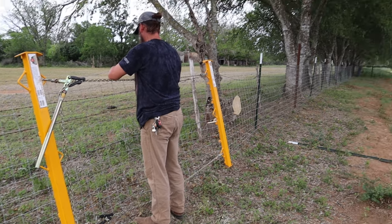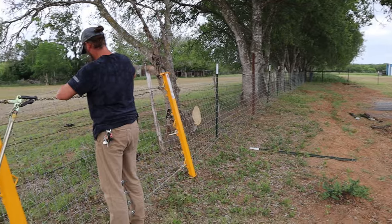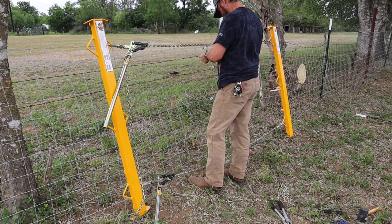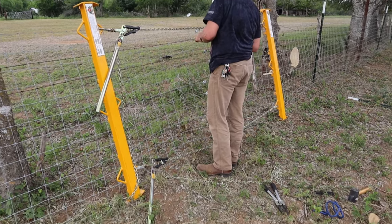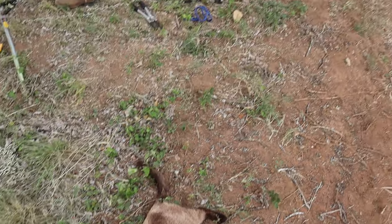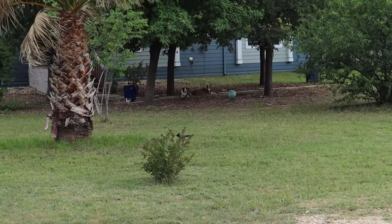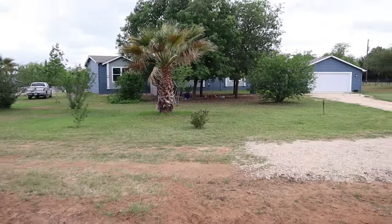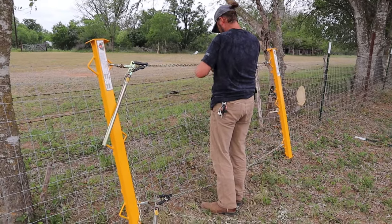So I went around and I took all of the wires off all of the T-posts, so the fence is not attached to anything except for at the very end with the gripples. And he just cut down the middle so that we can remove the gripples that we put on to lace it up the other day, just temporarily. And he's got the stretcher bars and the chain on. We have our straw boss right here, Mr. MacArthurson. And then our audience over there under the trees, the whirly girlies. And it's windy, and there's possibly a storm coming in, but we're gonna get this fence up today.